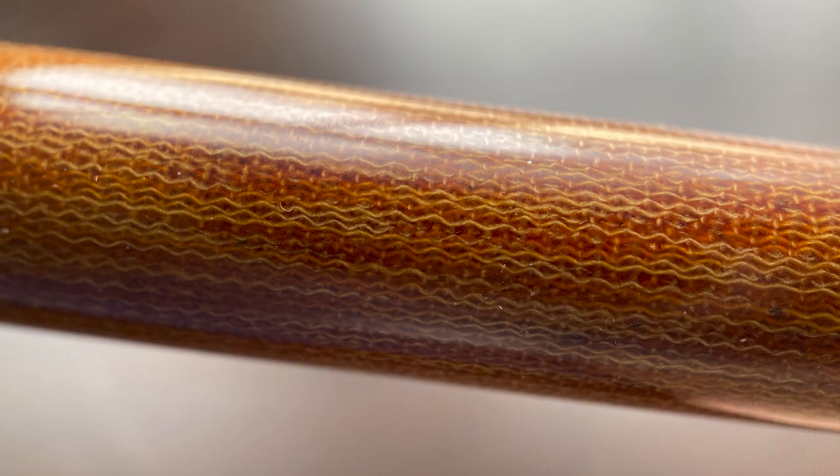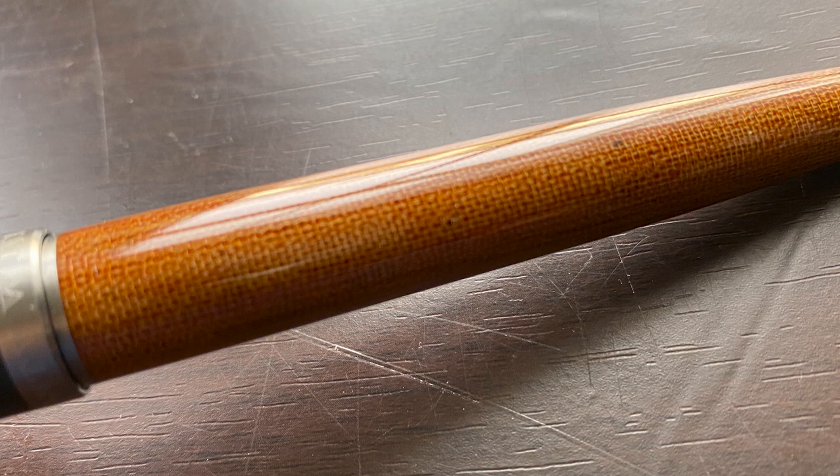I think this micarta material looks great. Micarta is actually a brand name but it's been genericized — meaning the trademark has become synonymous with the product itself, like Kleenex, Band-Aid, or Escalator. It's a solid composite material comprised of layers of resin and cotton linen, machined from a flat billet into a round dowel and then into its final shape. With the microscope shot you can get a good look at the woven fibers. One of my pen regrets is not getting my hands on a TWSBI micarta model — they had come and gone before I was really into this hobby. That pen had more of a rough exterior as opposed to the smooth one on this pen. The nice thing about this presentation is that it's coated with a clear acrylic resin, so if it should ever wear or age it can be easily renewed.